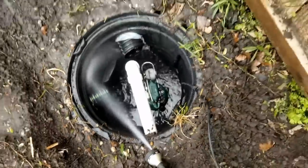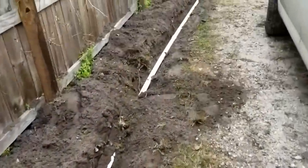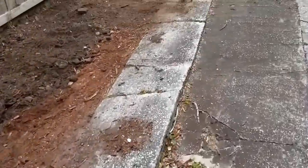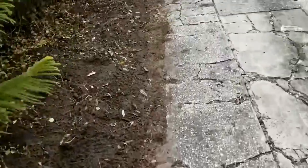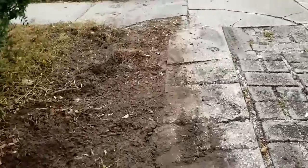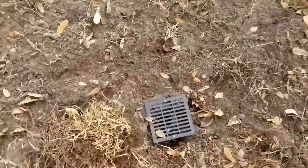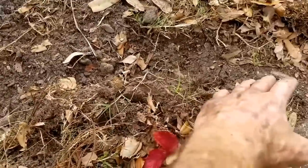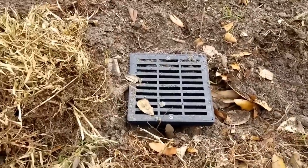Let's walk out front and see what's going on. You can see these guys are backfilling. It's a long trip down this hill. Simple to backfill — just use your rake, pull it back on the trench, leave it a little high so it settles. I don't know if any water has made it out here yet because this is a long ways out. Not yet — it's going to take a couple of cycles to get that water clear up here to the little basin. We went ahead and made a little trench to bring that water over to the driveway and let it out onto the street.